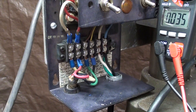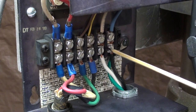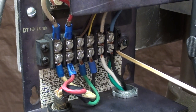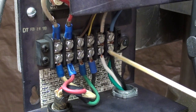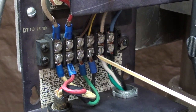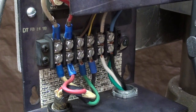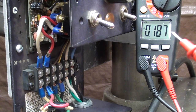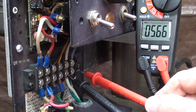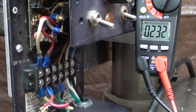If you look at the terminals here, the two on the far right are the input lines - so that'll be household voltage, around 110. These two terminals go to the field windings in the DC motor. These two go to the armature, and that's what can reverse the motor. First let's check the AC voltage - these other ones are DC voltage. I'm set on AC here, this is the input voltage - 120 volts more or less. Now I'll switch this to DC.